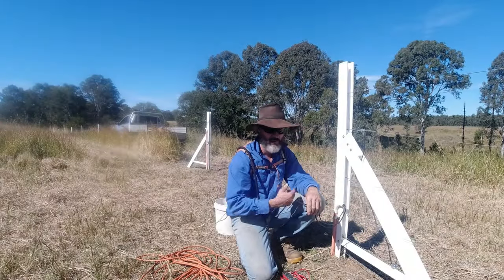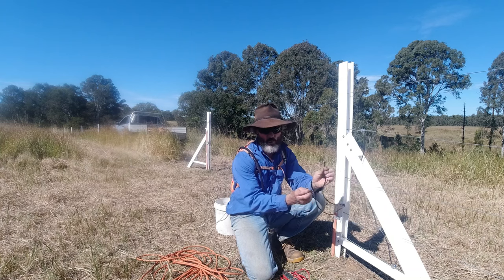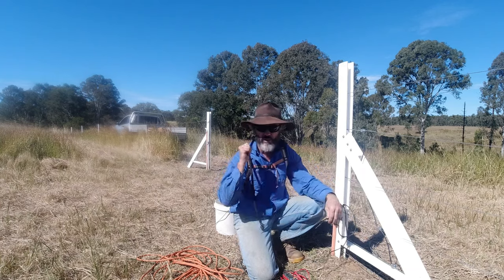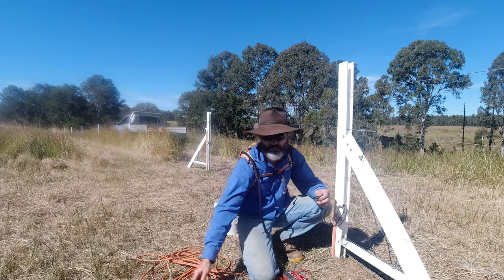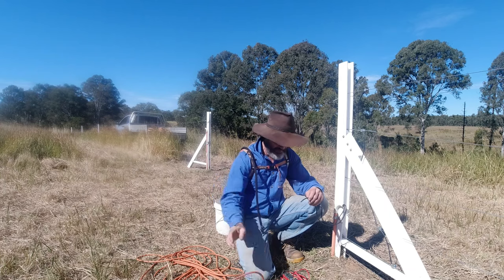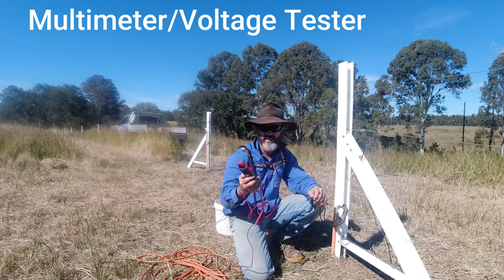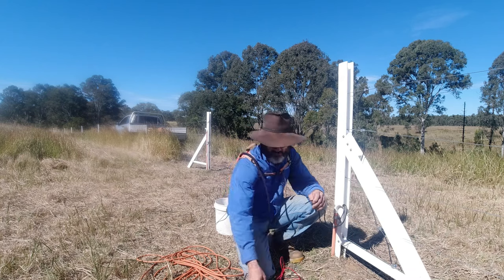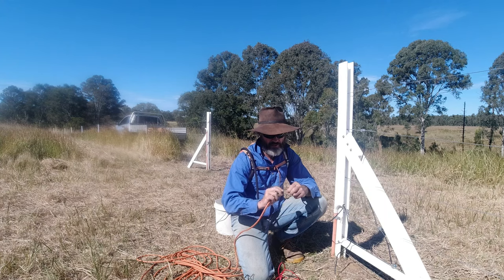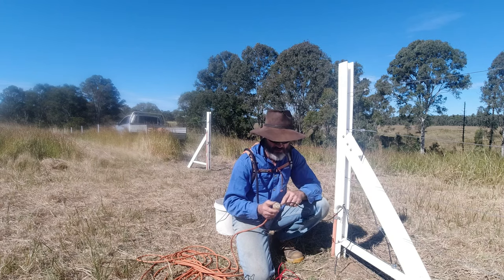What I forgot to do when I ran these wires through is mark both ends of these cables. So now I don't know which end meets with which. You can't really put the earth wire on one end and then have it on the hot wire on the other. So my son's an electrician - just come out of his time so he's qualified now. He showed me a little trick. I've got a power lead and also a wire tester here. What I'm going to do is put one of these wires through the earth of this power lead. As long as you use the same on both ends, I'm just going to put it to the earth because it's easier to find.